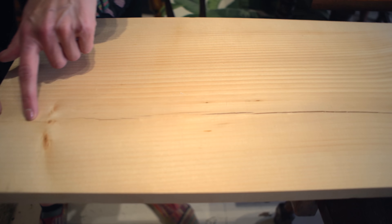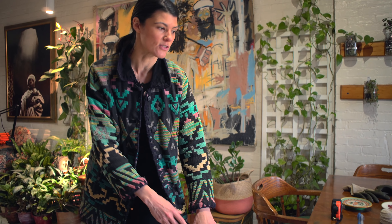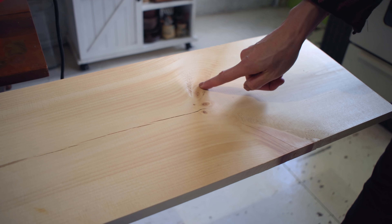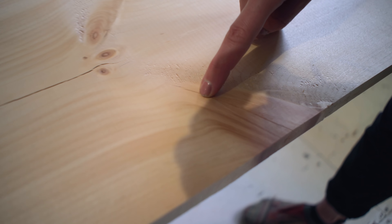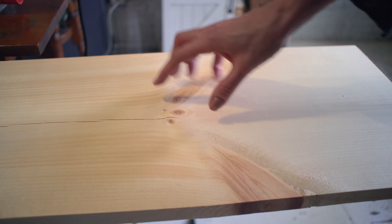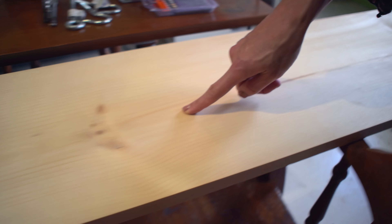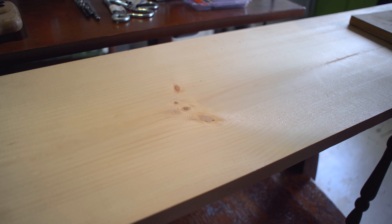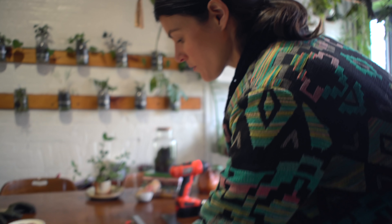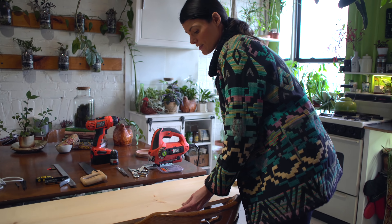If you look at this, you'll see the wood is already cracking, which is going to be a stressor because you're going to have to put holes in the wood, and if you drill into a crack it could actually split. Check both sides. Over here you see another crack happening, and then there are knots — there's a crack happening in this knot. This would not be a good place to drill a hole. You want to make sure that if the wood has knots, those knots are going to be contained within the hole itself. If you move down this piece of wood, you'll see that this area could actually work — if you imagine cutting a hole there, those knots are contained. This is just a solid piece of wood.